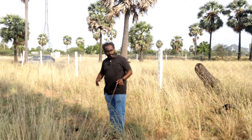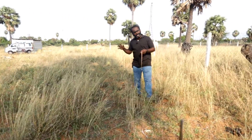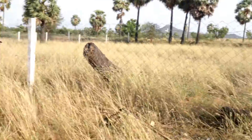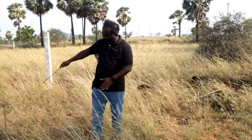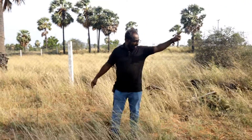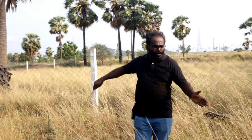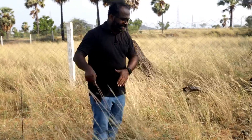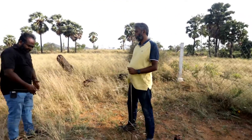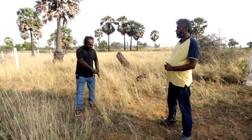Finally, we found a stream here, and we made four markings with the help of steel rods — 1, 2, 3, 4 — in a stream. Now our client's requirement is almost the same distance from both the fencing, he needs a well. So what we can do — we need to find a cross stream. We have already found a good water stream with two wells at both ends at a certain distance, that is a good stream. Now what we do: we can make any point of this line the bore point, but to get more probability to get water, we will find out another source which is crossing this line. In this area that is convenient for the client, we will find out a cross stream passing in this area.